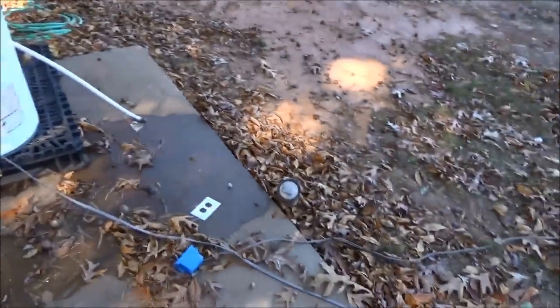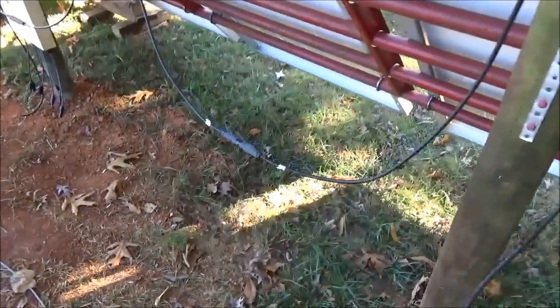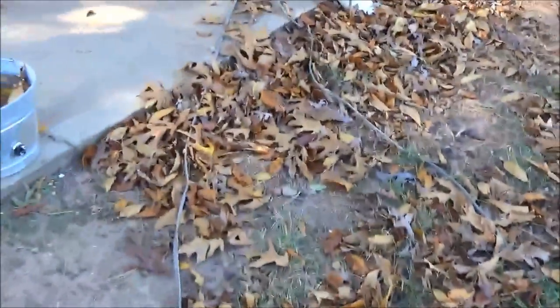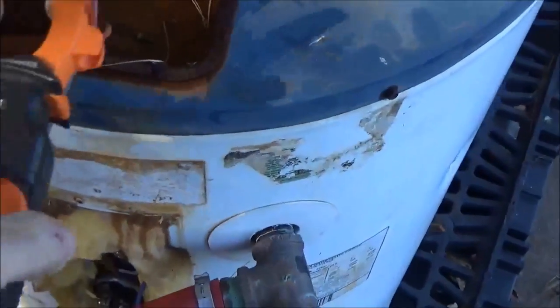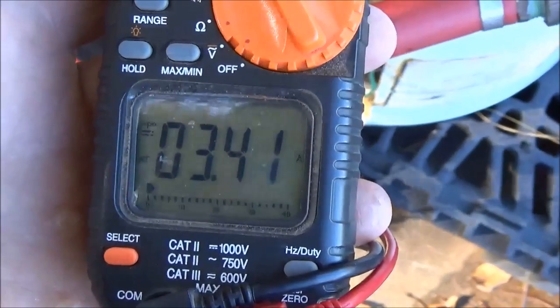Consider this as an alternative to your hot water needs — solar panels wired directly in series, nothing fancy. No inverters, just MC4 connectors connected together. I know this is kind of crude here, but we're just testing. I was using these four panels to make scalding hot water and it does work. Now my panels are in the shade so I can't really show you a good amperage reading right now.